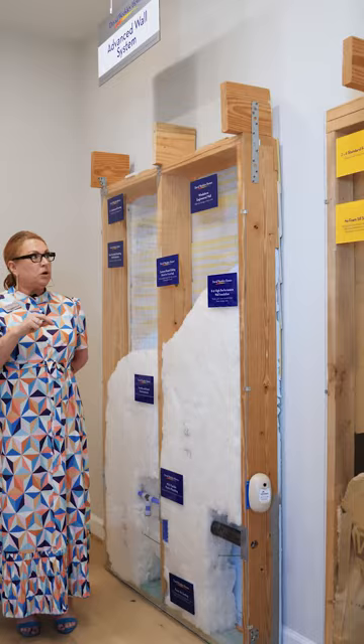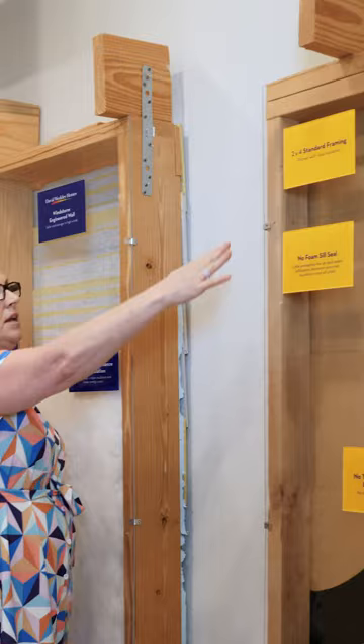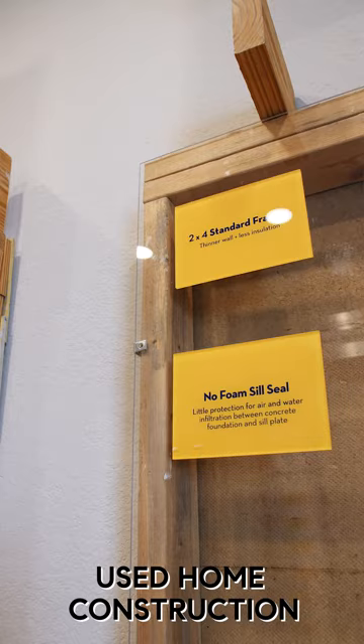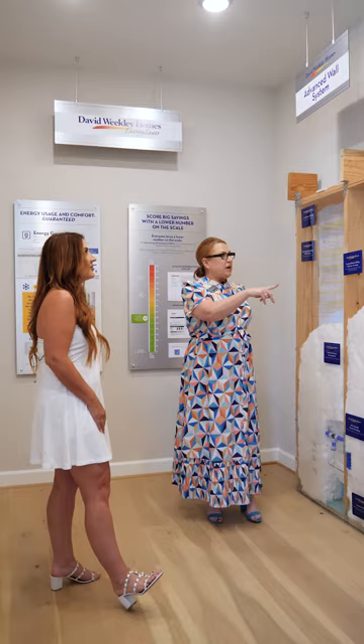Another thing that's really important is we use advanced framing. You see our ceiling joists line up with our wall studs. The frame of the home is doing its job and the foundation is taking all of the weight, so everything is doing it as it should. If you see here, nothing lines up — the ceiling joists do not line up with the wall studs. You actually have to use a double header to support the weight of the roof. If you don't use a double header to support the weight, the studs can sag and your sheetrock can crack.